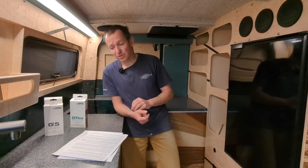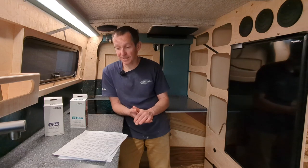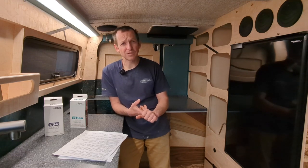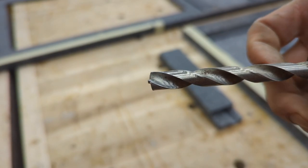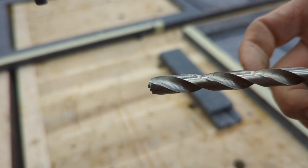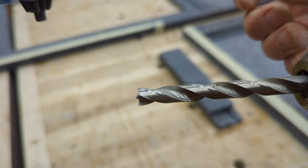Now, drilling these holes is kind of stressful. You could easily blow out through the backside, so a precaution I take is I start every hole with a little pilot bit, and then I end up using a brad point drill bit, which leaves a fairly flat hole, but I have ground down that center tip to make sure it doesn't get too close to the top surface of the countertop.